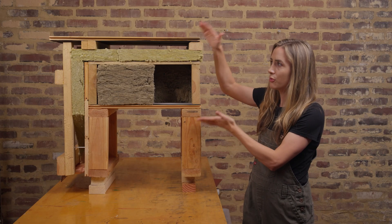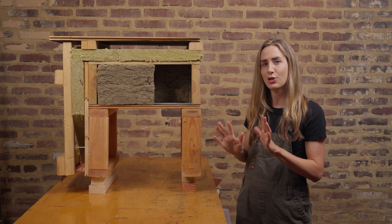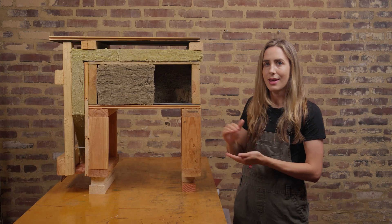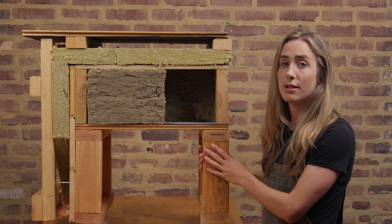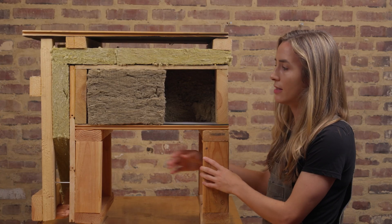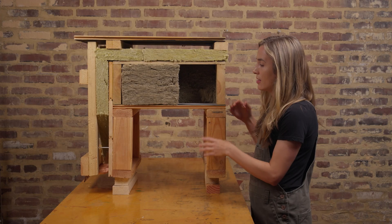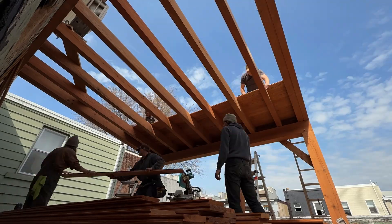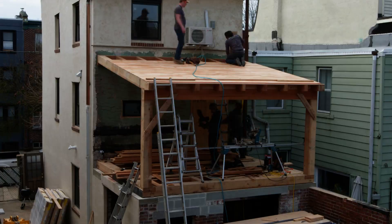Here is our model. We've got our roofing system here and our siding system on the side. You'll have to use your imagination a little bit, but I'm going to walk you through our different layers in the layer cake. Our roofing system really starts above our joists — these are our timber rafters. Our first step is a red oak tongue and groove, which will be our ceiling treatment with Viking purified linseed oil applied as the finish.